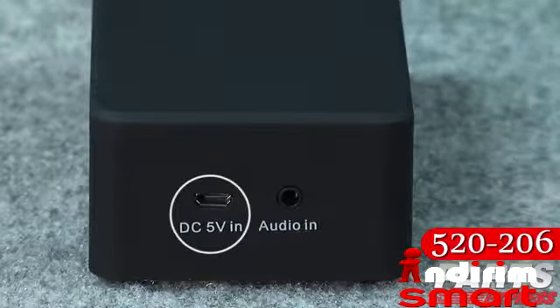How does it work? Well, there's a couple of inductors inside the box. They sense the electricity moving through the voice coil of the internal speaker in your portable device and pass that signal along to the internal amplifier inside the box.